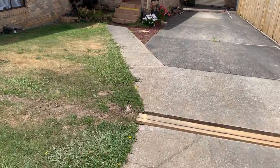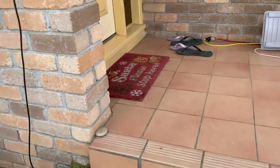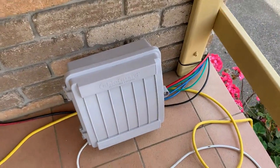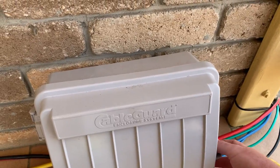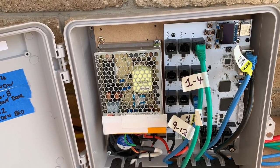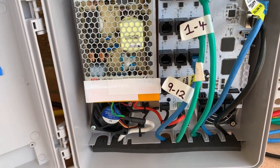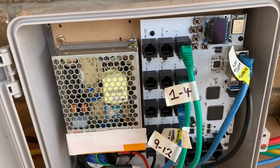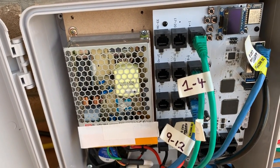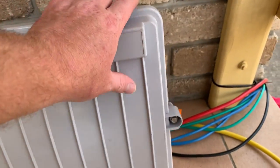Next door is all 12 volt and I've got absolutely no power injection happening. I'm using one of these CG boxes — it's nice and sheltered. Inside we've got a little 5 volt power supply just to power up the F48 board — totally more than what's required — plus a little fan and vent just in case things get warm. This is receiving our data and distributing it out via CAT cables to each one of the boxes located around the yard for the next little props.